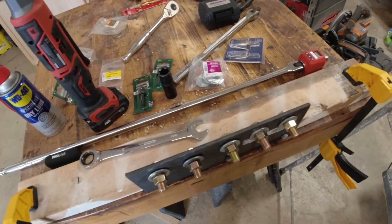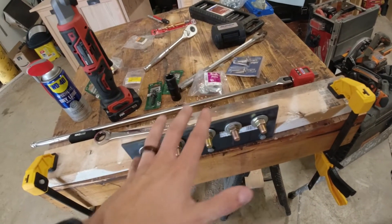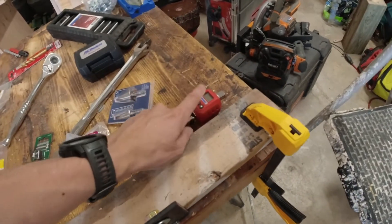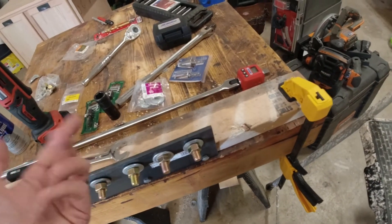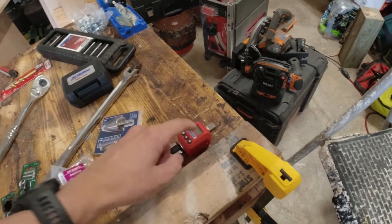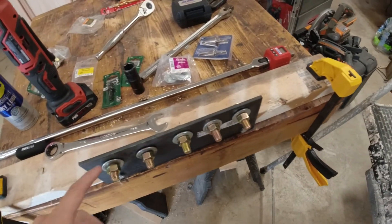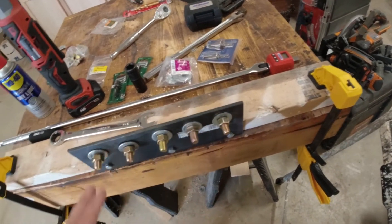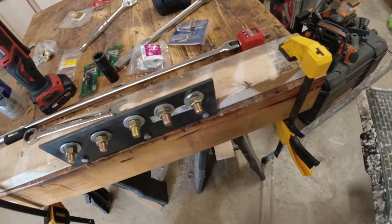What I'm going to do is put the three-quarter-inch drive on the right-angle impact and tighten all five bolts for five seconds each — as soon as it starts impacting I'll count to five, stop, and move to the next one. Then I'll come back through with the torque meter set to peak torque, so every time I loosen a bolt it'll give me the peak torque reading, I'll write it down and put it on the screen in both inch-pounds and foot-pounds. Then I'll re-torque starting at about 25 foot-pounds and step up to 35, 45, 55, 65, and keep going until the tool can't break them loose anymore.